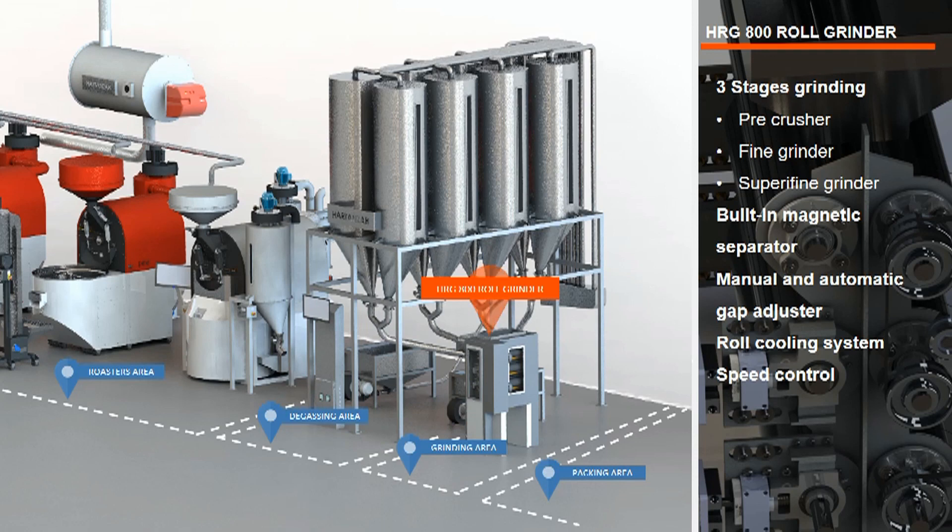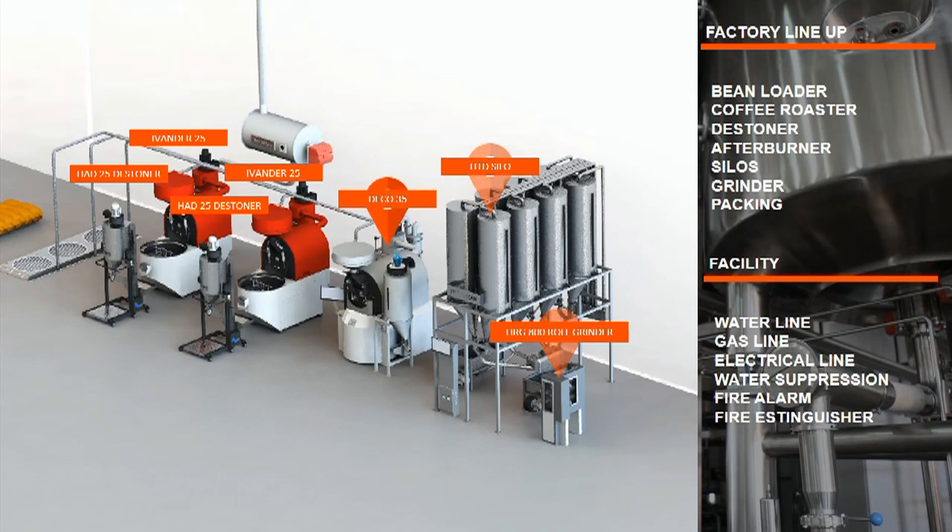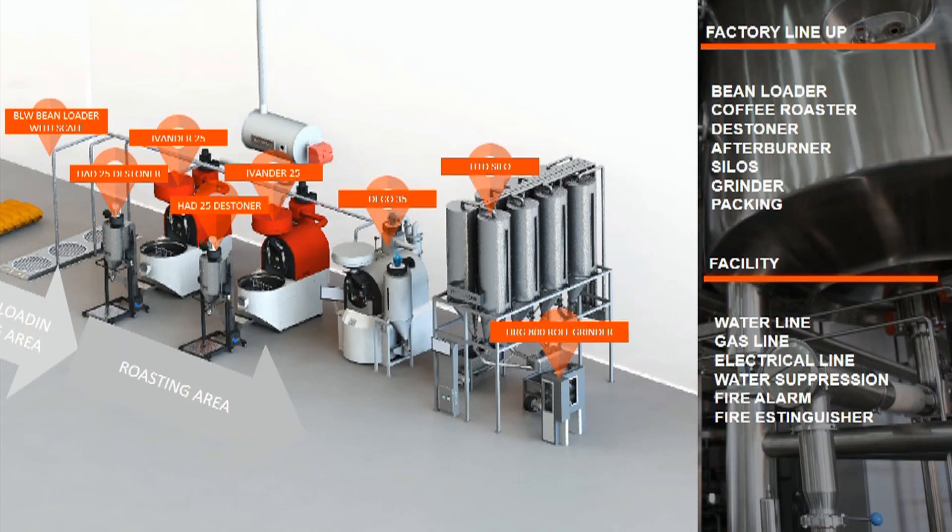High precision roller gap and temperature control make it the preferred choice for all ambitious grinding applications. The proven high-precision gap setting mechanism ensures total gap control and roll parallelism. A touch screen and intuitive process control software make management of grinding parameters easy and provide complete process monitoring. Process parameters are managed by recipe and are continuously monitored. Operators interact easily via touch screen or from a remote control room. The Hardin's HRG roller grinder is designed with a modular setup allowing a wide application range, including instant, filter, espresso, and ultra-fine coffee. Now we have a complete setup for our coffee roasting plant: from the incoming area with the bean loader, through the roasting area with three Hardin's roasting machines complete with stoner, to the Hardin's on-demand silo for degassing and storage, and finally the Hardin's roller grinder.